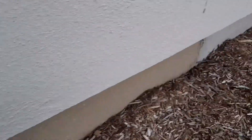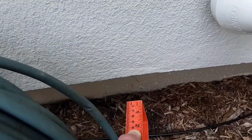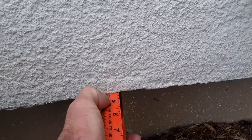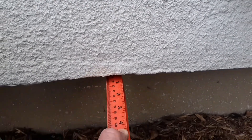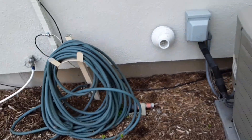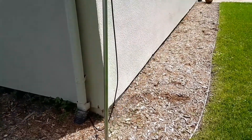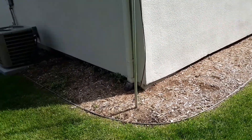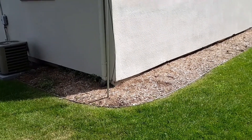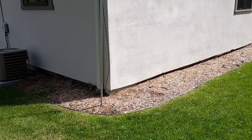Now let's go to the center of the wall where there was bowing — this location is probably the most severe. And now we're at four and a quarter inches. This whole foundation wall has bowed in on the side of the house and also on the back of the house. This is going to be a very expensive repair, which will probably require some tie backs. And that's what you will find with heaving on foundation walls.